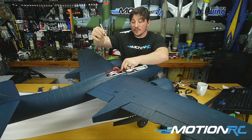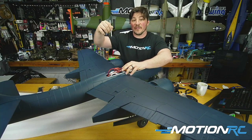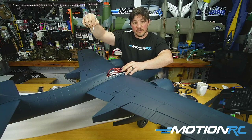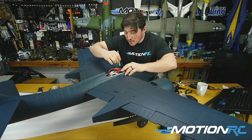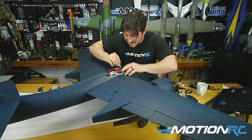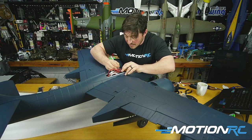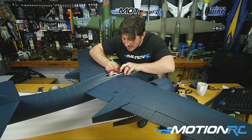So as long as I have that right, that means on the gyro itself, there are three other dip switches. You had the first three that set up what type of aircraft you want the gyro to do. So normal, aileron, control surface, combination, delta, flaperon, V-tail. Then your first three switches are just 1, 2, 3, and it says aileron, elevator, rudder. Since they're all there, I know the rudder I want to reverse, so I'm gonna just push that one over.